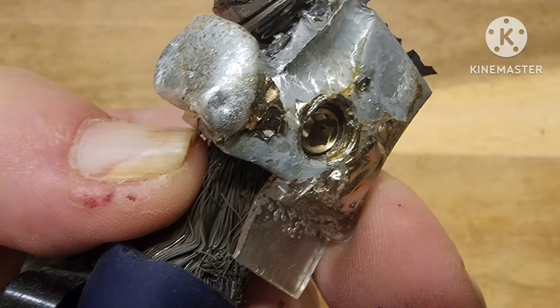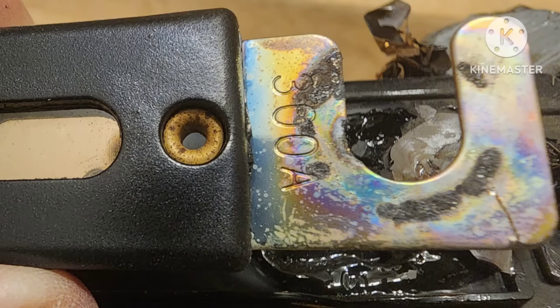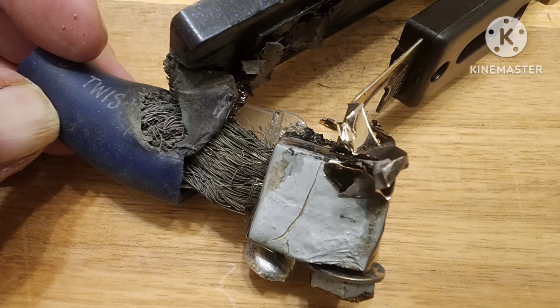That arcing is caused by a loose connection. If you look for the arcing, you can always tell what connection was loose. When I got the cover off this thing, the end literally fell off — it wasn't touching anymore. It was probably noisy as crap before it finally got attention, but it was a bad situation.